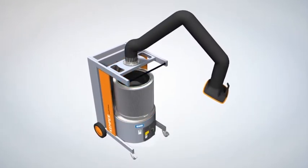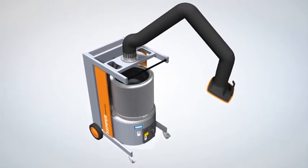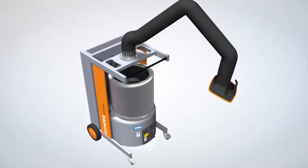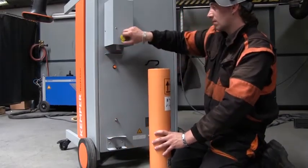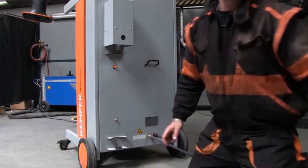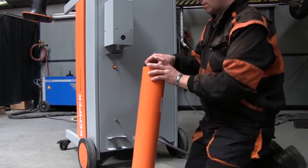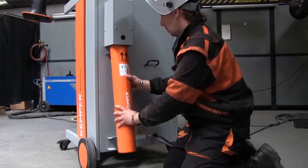The 50 square meter EPTFE filter cartridge is cleaned differential pressure controlled. The hazardous fine dust then enters into a dust collection cartridge and can be completely removed and disposed without contamination. This secure and reliable form of dust removal is unique and offers the welder maximum protection as well as simple and speedy handling.